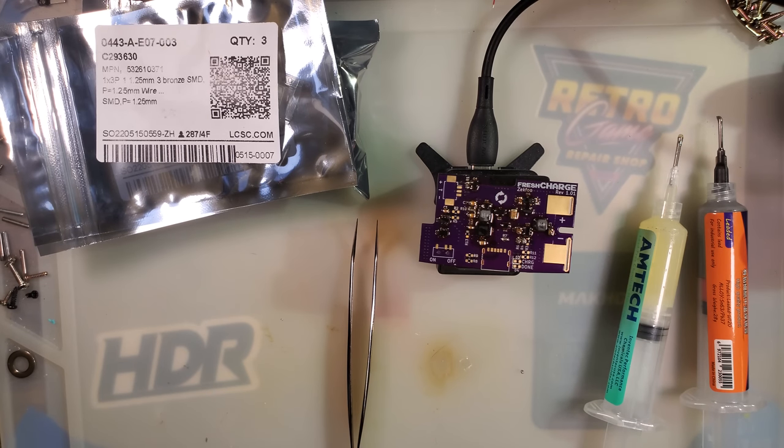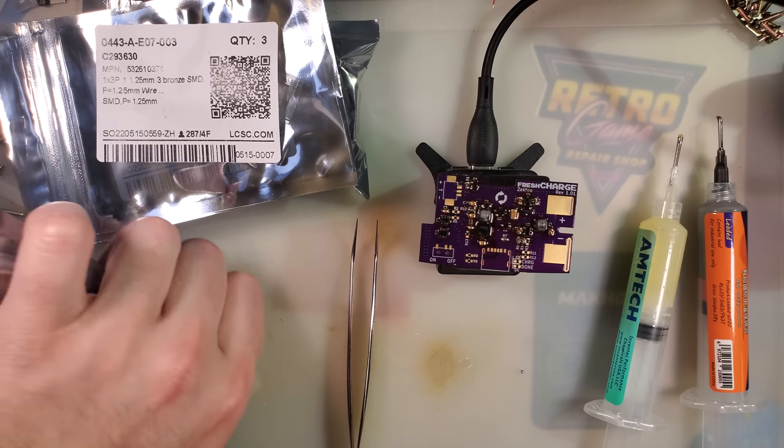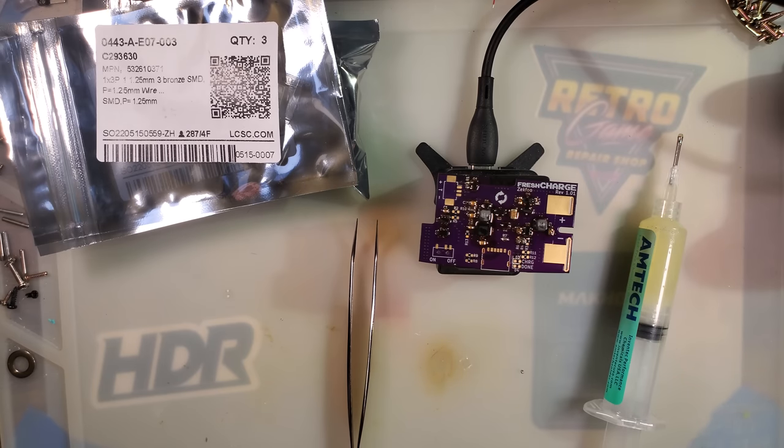1.6K. I bet that's the third one. Oh, no, it's not. R11 and R12. Oh, these are for the LEDs. But anyway, the formula is super simple. It's just some algebra and cross multiplication to cancel out the division. Problem is, it's very easy to calculate resistor values that don't actually exist. What did I say? R11 and R12? Yeah.